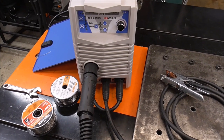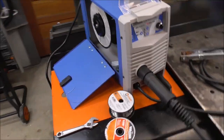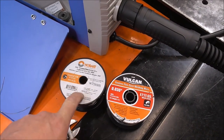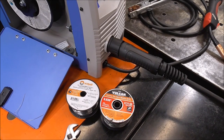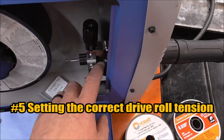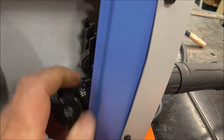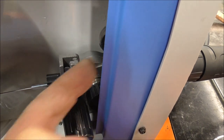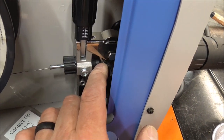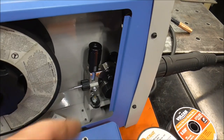Now that we've selected the proper polarity — DC electrode positive for solid wire, DC electrode negative for flux core — we've selected the proper wire. I like 030 because you can use it from sheet metal all the way up to quarter inch, which covers pretty much everything in my workshop. We've set the reel tension and selected the proper drive rolls. Now we need to set the tension on the drive rolls. There's a drive motor that pushes the wire between two rollers. Too much tension crushes the wire and wears the motor; not enough tension causes slipping and an unstable arc.